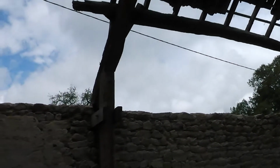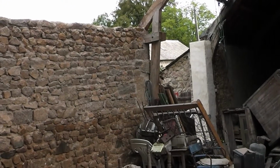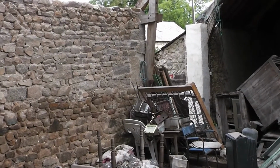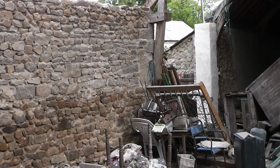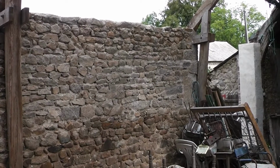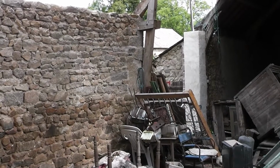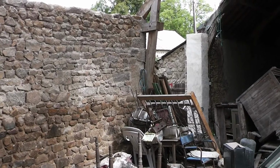And then coming round, that's the back wall. You can see there that fairly white looking pillar. That's the new pillar that we've had built to strengthen up that wall. There was some concrete there where they obviously narrowed it, as well as taking down. If you remember in an earlier video I said they'd actually raised up the wall. They'd also widened the door, so we've put the door back to probably what was its original width. We've just done that in block work and lime rendered it.